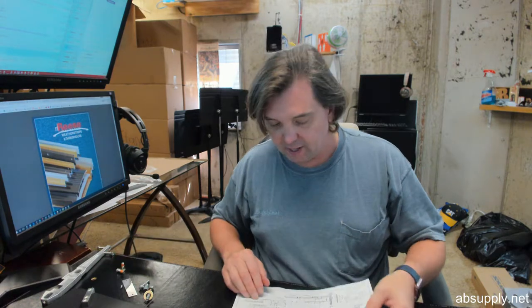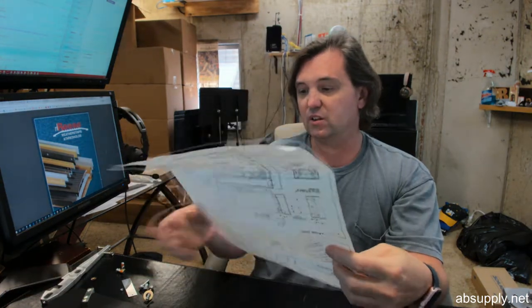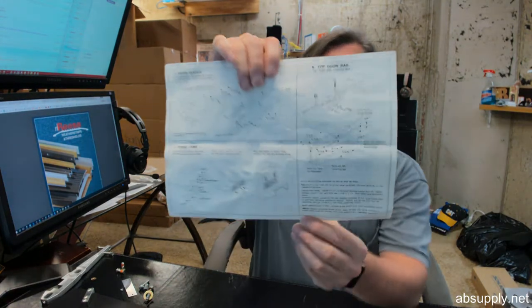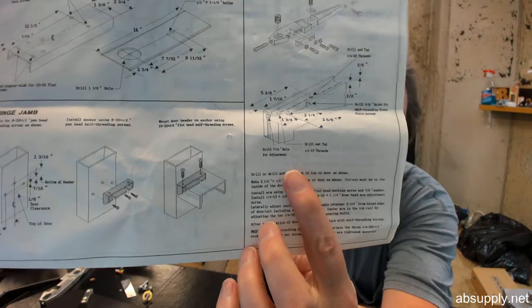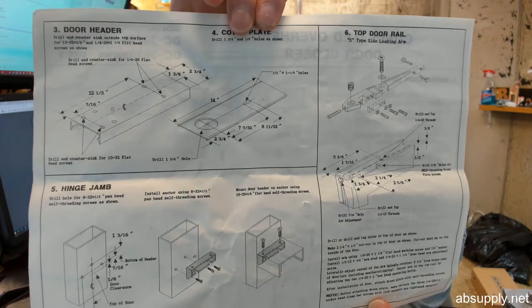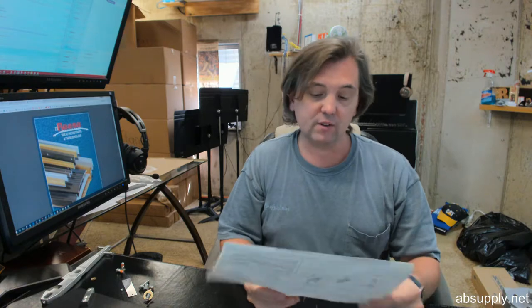There are more dimensions on page 2 but review them, reality check them, lay them out, and understand them. The first time you do a concealed closer the second one will take you one third of the time. Page 3 is an overview of everything, giving actual dimensions for drilling and tapping the top arm hole and a visual overview. The cover plate will be part of your aluminum frame construction, and all header preparation is listed there. Page 4 verbally describes drilling, attaching, and tapping holes.